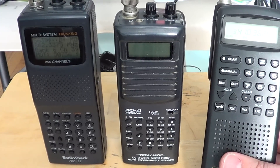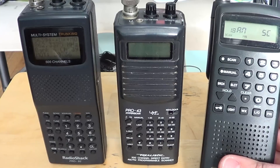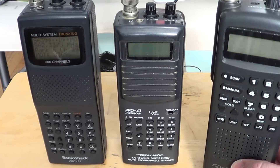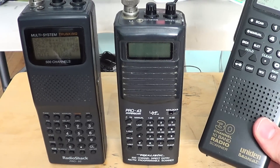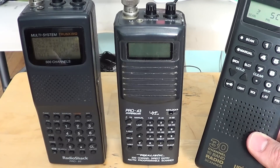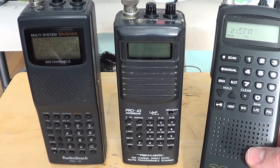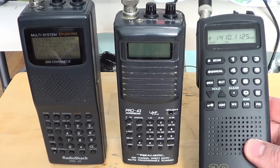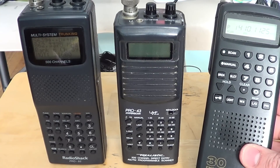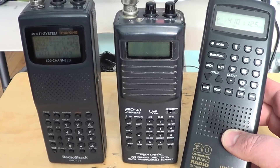You can hear baby monitors, police, amateur radio traffic, taxis, and companies chatting away with their daily business all through the band. This is the basics of basics. It usually doesn't have many channels — this one has 30, some have 100 or 150. It scans in a very basic way with very few options. When they're very cheap — $79, $89 — these tend to overload easily, so sticking with the little rubber duck antenna is probably the best thing you can do.